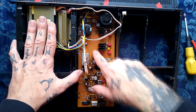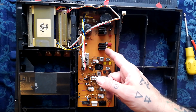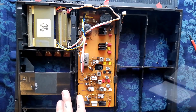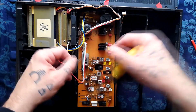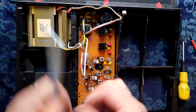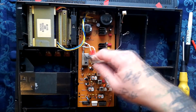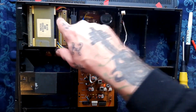All of these cables need to go through this gap here. That just leaves us the meters, the far side of this AC transformer, and this board that has the filtering, rectification, and fuses for the power supply. These transistors are voltage regulators, and here's your main 80kHz bias oscillator - these will be the adjustable controls for the individual record oscillation. It looks like we're actually screwed into the chassis here: standard one-and-a-bit centimeter wide ferrule screw. There's a common ground wire coming from beside this big capacitor, then through a screw up here - same kind of screw.